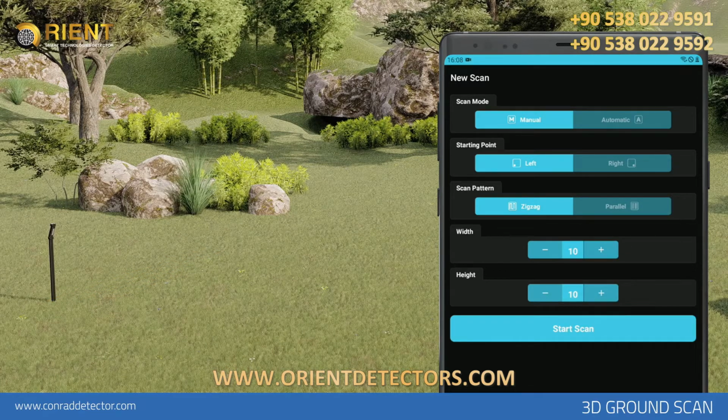You should start the scan at your start point and end it at your ending point, as shown in the graph. When the number of signal pulses entered for each row is complete, you must proceed to the next series of scans. The direction of the measurement device should not be rotated when you move to the next row.